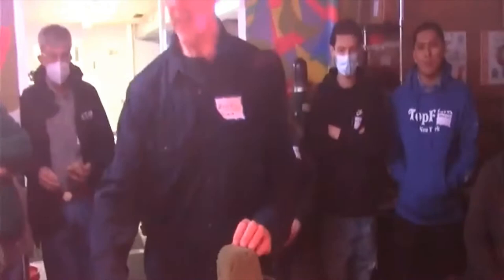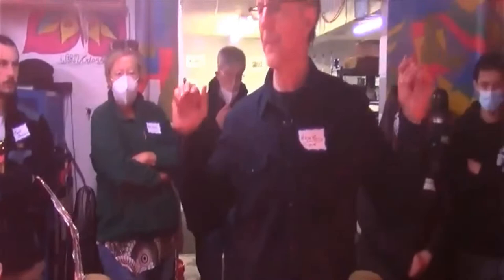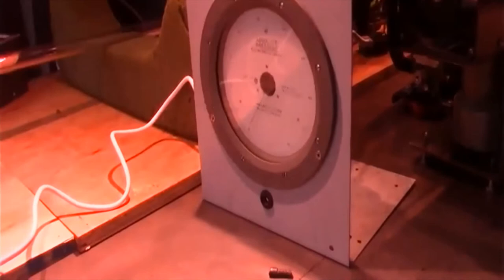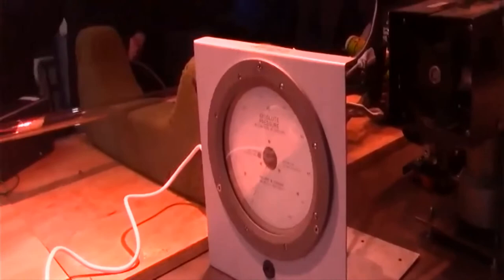We're going to fill this to about six millimeters in pressure. So if this pump can get down below six, you're fine. That means you can have a really, really cheap pump. You need something to measure the pressure inside - to measure that six millimeters. I've used a little absolute pressure gauge here, but you're all glassblowers - you can make your own manometer in half an hour, and it's self-calibrating and more accurate than this could ever be.